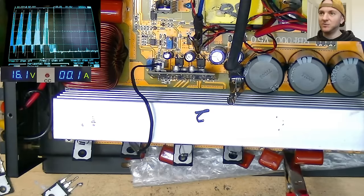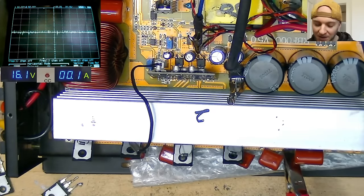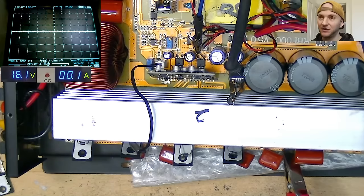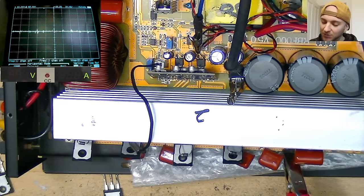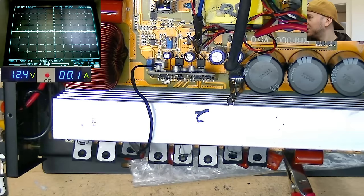Now, in addition to the diode being fitted, the other difference is that I've only got four fitted rather than eight. So if I'm going to use these or any really, I should try test fitting eight in place, just to make sure that it's not something to do with gate capacitance that's causing the weird shape with more of them fitted. So I've got the exact correct number of these for this inverter. Let's tack in all eight and just make sure that the wave shape looks the same as it did just then with the four, but instead with the eight.